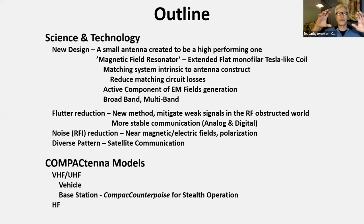There are several things important when shrinking an antenna and making it perform well. One is bandwidth — the bandwidth goes way down. So what can you do? You can make the element of larger diameter, or make it a sheet. This involves sheeting, and that helps the bandwidth. There was an IEEE article that took the sheeting of a quarter-wave antenna and made it various shapes, even rolled it. But that's not this. This is one-quarter of one-quarter of a wavelength, plus or minus, in height — very, very short. It's an entirely different design in terms of the physics.